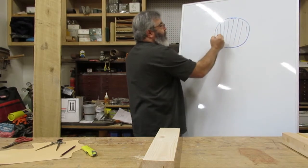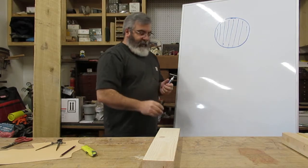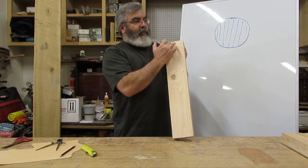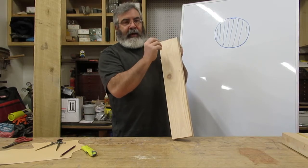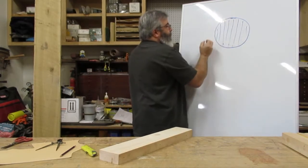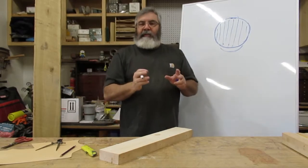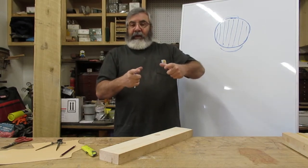Here's the side grain, and this is called end grain. This is much more difficult to cut than going with the grain. When you cut with a chisel or gouge around the lathe and you're cutting the end grain, it chips out and fuzzes up. Say I had this on a face plate on a lathe and I'm cutting this surface — I'm going to be cutting fine here, but when I get to the end grain it's just going to chip out. It'll also puff out, so if you're doing something really accurate you're going to have an oval shape.